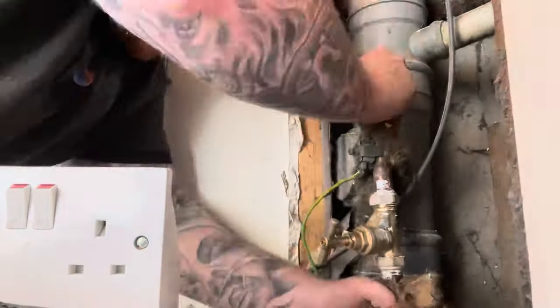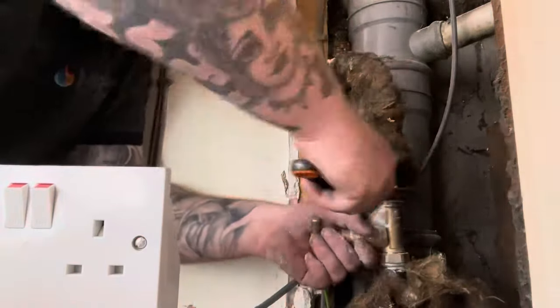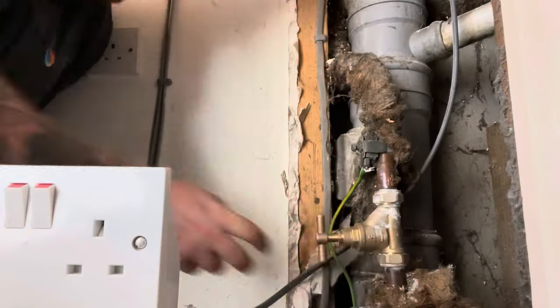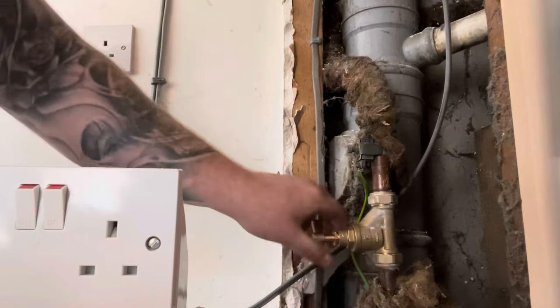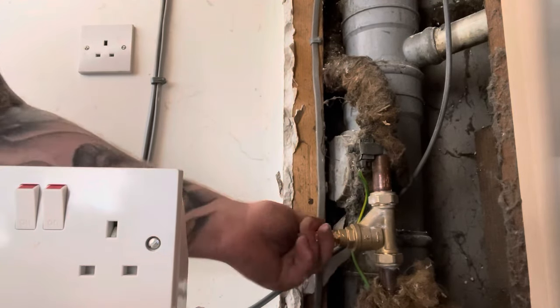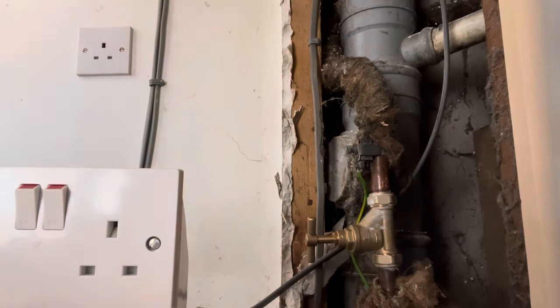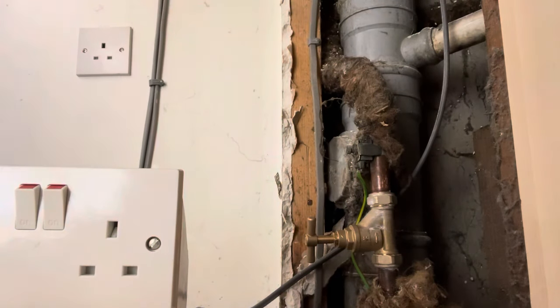I'll give a quick tighten up with my grips and shifting spanner, make sure it's slipped in, then you hold against yourself and tighten up, and wipe off the excess paste. Then turn the water on out in the street, turn it back on at the stopcock, and make sure your water's coming through. Although I've made it sound quite easy, it's actually normally a lot harder than it looks. I appreciate you watching this video — I'd love it if you could subscribe to the channel. Thanks for watching.